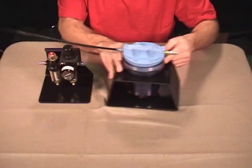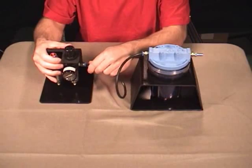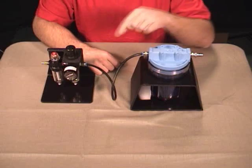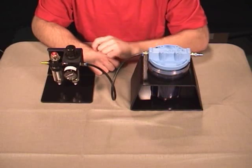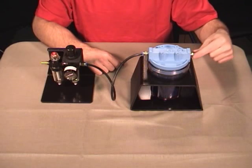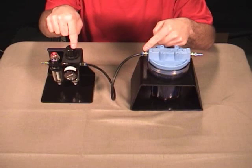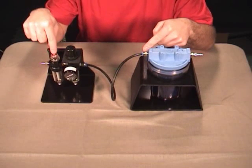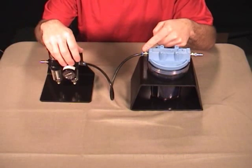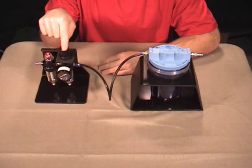So our air hose is going to connect here now. Then it's going to come out of the tubing and we push the tubing into this fitting — just like that. Really simple. You may want to put some thread sealing on the threads just to make sure you don't get any leaks. Our flow of air is into the desiccant filter; we connect our compressor hose right up to that. Out of the desiccant filter it comes through the black tubing to the filter regulator. The lubricator lubes it if you're using an oil-type handpiece, and down the line to your handpiece. That's how you connect the desiccant filter to the filter regulator for your high-speed engraver.